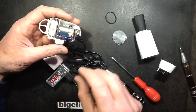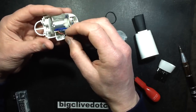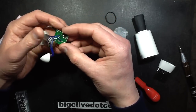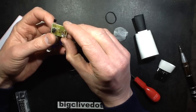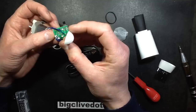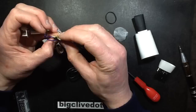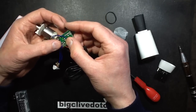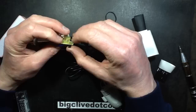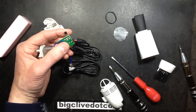I think that's just resistors controlling it — let's investigate further. Well, at least it works, and it was my error that I didn't see that switch. Let's take this out. There's a transistor and a button. Is that actually a current regulator? The negative goes straight out to the motor, positive goes via the switch and either switches to the LED and a resistor, or to the other position going down to the other side of the button. Could it even be a regulator? Let's take a look at that component through a microscope and see if I can identify it.